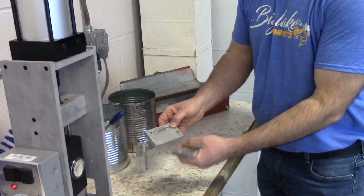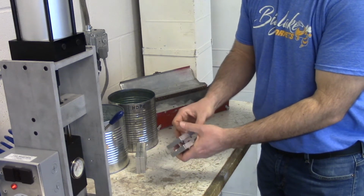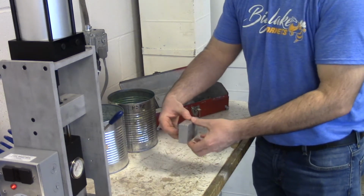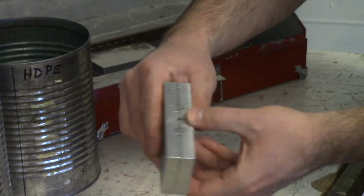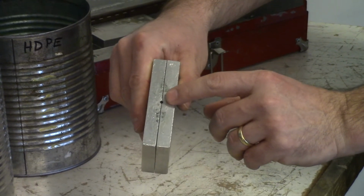In our class, we all have single cavity molds, so we won't see any runner systems in the molds that we have. So let's take a look again at our golf tee mold. If I open this up, I have my indexing pins to hold it in the correct fashion to each other. I have my sprue opening where my plastic is going to enter the mold cavity.